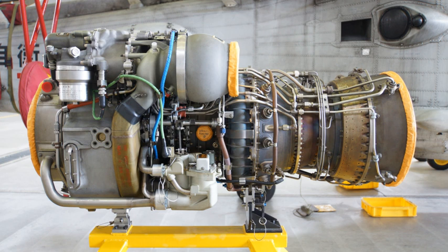In the late 1980s, GE also proposed a much larger turboprop, the T407 GLC38, with a five-stage axial, one-stage centrifugal mixed-flow compressor, an annular combustor with 15 burners, a two-stage compressor turbine, a three-stage power turbine, and max take-off power of 6,000 SHP. The YT706 engine is based on the CT7-8A engine.